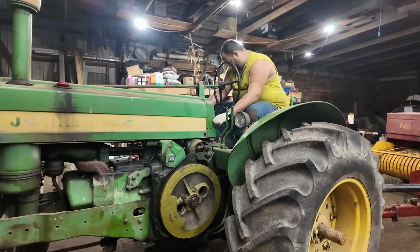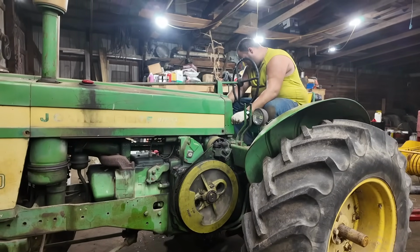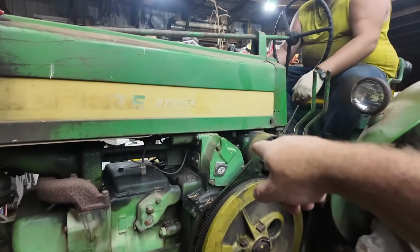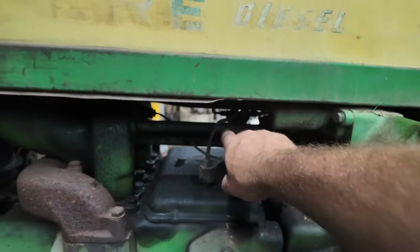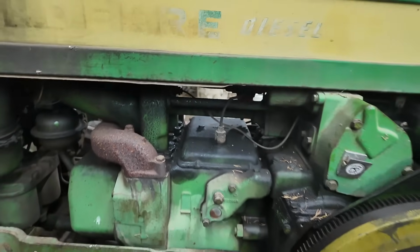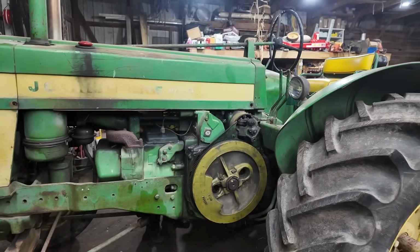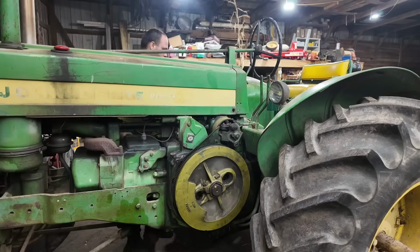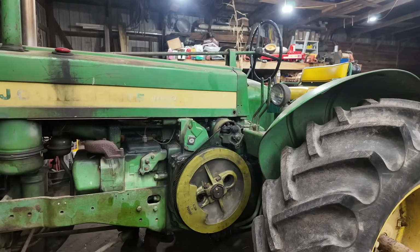It does not share the same oil as the engine of the diesel, but it shares the same water. And the exhaust, for winter starting, goes through the intake manifold. This is the exhaust pipe there, and then it goes down to the little muffler here. That goes through the intake manifold. Yeah, that's ingenious. And in the wintertime, you leave your 4-cylinder engine to run a while, and you really should let it warm up in general before you actually go and start the big engine.